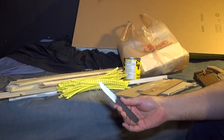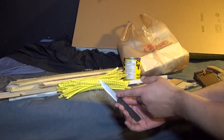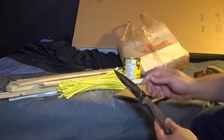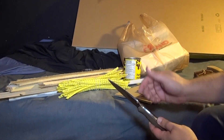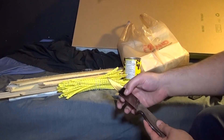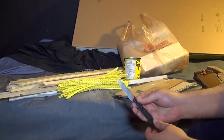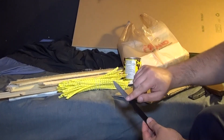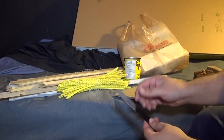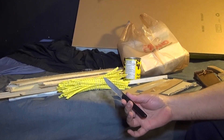After regrinding this, the thickness of the apex bevel was between 10 and 20 thousandths. You can't actually see an apex bevel on this because I modified it as I was doing the work. But it started out looking similar to this — there's a primary bevel, which turns it from full steel stock into an actual tapered cutting profile, and then there's an apex bevel, which is much steeper than the primary bevel, and that's what forms the apex, the cutting edge. Initially, this had an edge between 10 and 20 thousandths thick behind the apex bevel, and the apex bevel was sharpened at around 10 degrees per side. I was curious to see what I had to do to make it fail at that point.